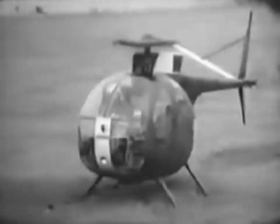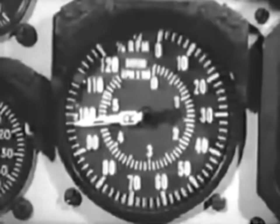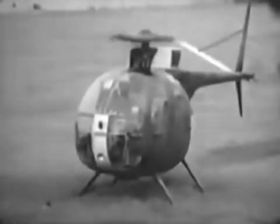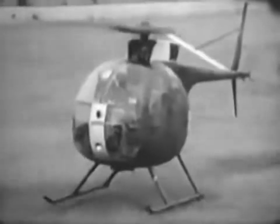As with any turbine helicopter, takeoff to a hover is started with collective pitch full down and throttle full open. While watching the N2 tachometer, the N2 governor is adjusted to operating power turbine RPM. Cyclic control force is trimmed to neutral with a cyclic trim switch. As collective pitch is increased, you will discover that the OH-6 is different. There is practically no turbine lag. Response to increased power demand comes in less than 1 second.